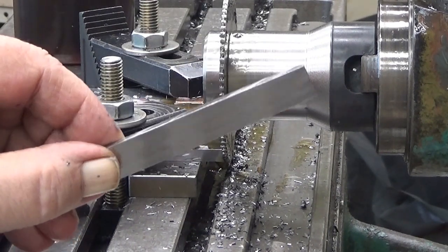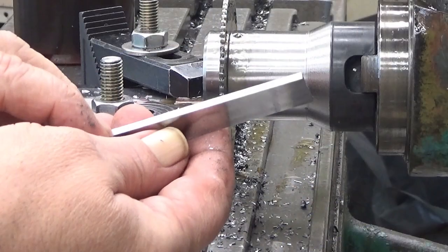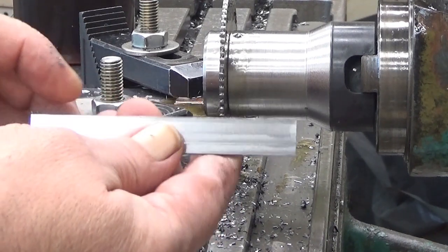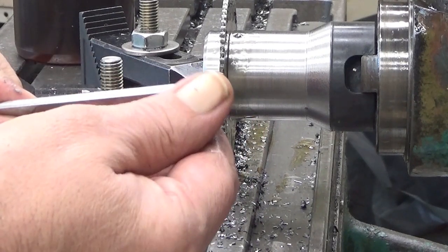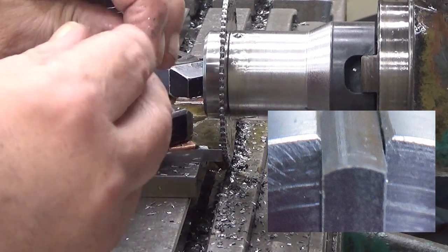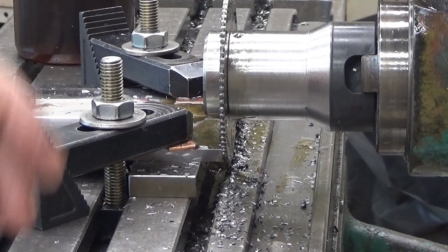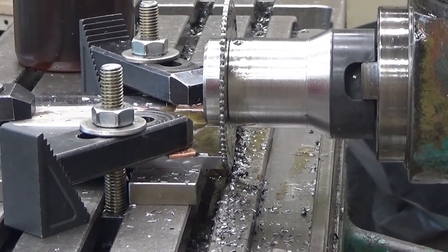That's the workpiece. I will have a photo. Well, that slitting saw cut is not perfect, but it's good enough, because this is going to be just there in the groove. But this side, which is now the thing that is facing the cylinder wall, it's perfect. It's rounded. I don't know whether you can see this. It's rounded here, and it's really perfect. Wow. First one done. We need to see if it fits into there. I will clean up this mess. This is a messy job.